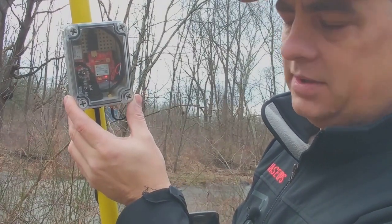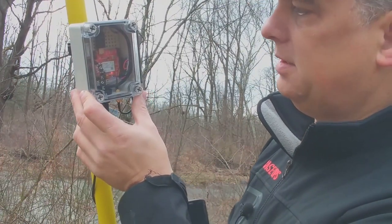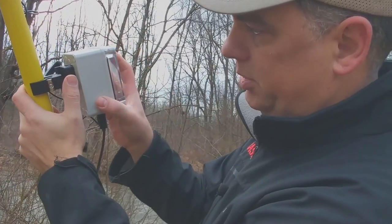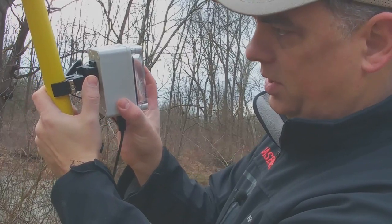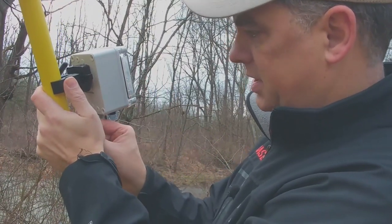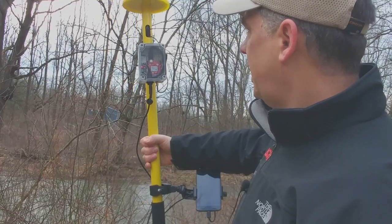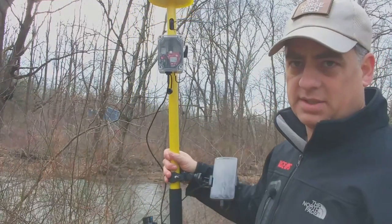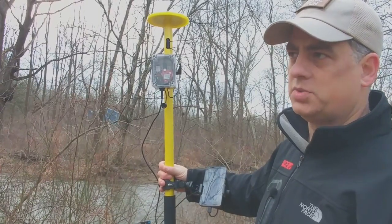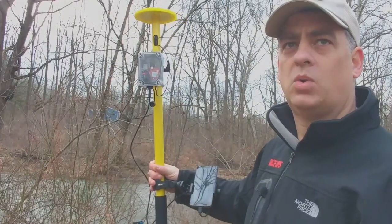Now we'll go over the wiring and everything later, but it's probably a good idea, if you're having a rover, to have it in a waterproof case, just to keep it safe and dry. Also on this, we have what a lot of camera people use, a V-lock or V-channel system, where you can take this off, and it's pretty neat. So that will allow you to take it off and put it back on pretty easily. And it keeps it secure also. But other than that, right now we have our regular GNSS antenna. It's just a small one that you can get probably for $20. We're going to upgrade that to a Harxon GPS 1000 model, which will give us a lot better accuracy and ability to do missions that have maybe tree cover or not a very good view of the horizon.